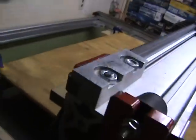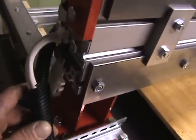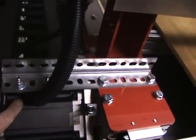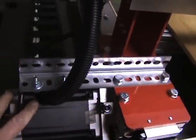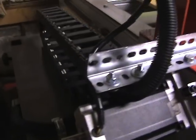The Y-axis and Z-axis come out from the e-chain, and I just put some conduit cover on it — worked out pretty good. I went from a smaller conduit to a larger conduit, so all four lines go down through the e-chain. Over here on the side — I'll try and get a shot here — these are the axis connections to the stepper drivers.